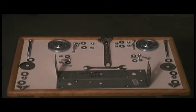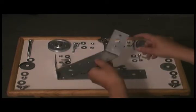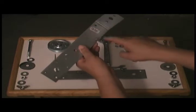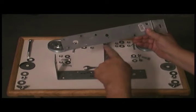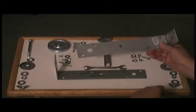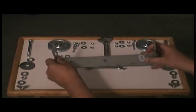First things first, there's 4 holes that are used to hold the 2 L's together to create one unit. Each pulley requires 2 holes. Use the existing hole to center the pulley, then drill the 2 holes. You have to pre-drill a total of 8 1/4-inch holes and 1 3/8-inch hole. The 3/8-inch hole in the center is to mount the unit to the tripod.